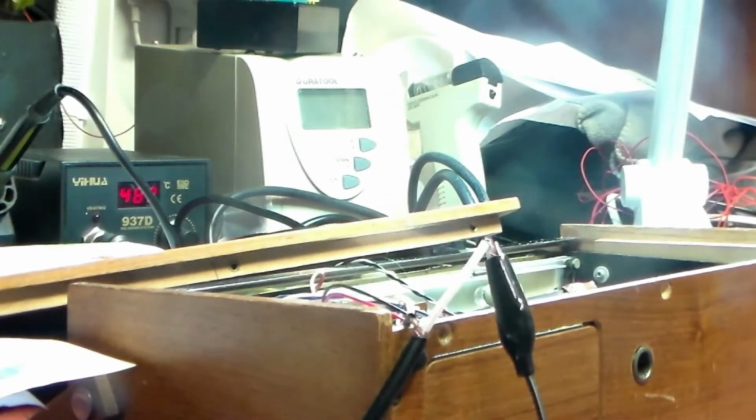This was with the aerial down, by the way. So there you are, it's working now on VHF. AM, however, it isn't yet, and there's another AF117 on the switchboard here, which again, I probably want either its screen wire cutting or changing. So that was going to come out as well. But so far, the set is now coming back to life.